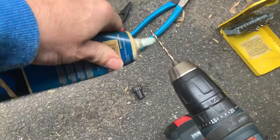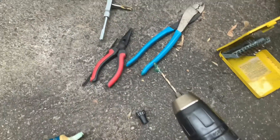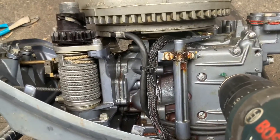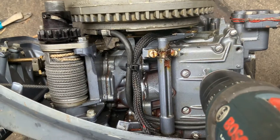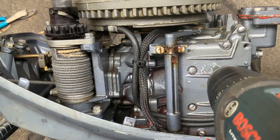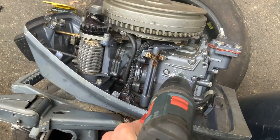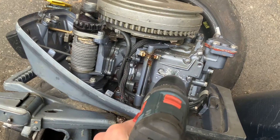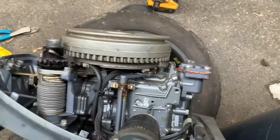It doesn't matter what kind of grease — that's perfect. It's pretty soft metal so I wouldn't worry too much. That spot looks right — looks good. Okay, that was a small bit. We're gonna go one size bigger now. Quarter inch is the next size I'm using.